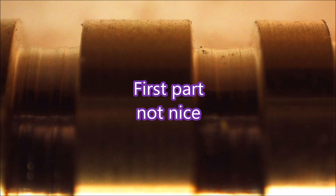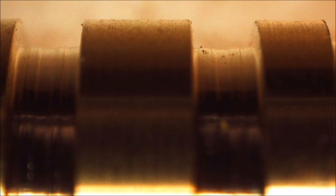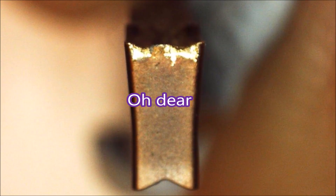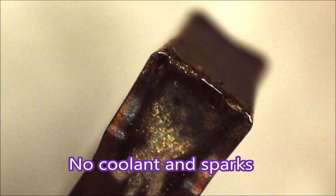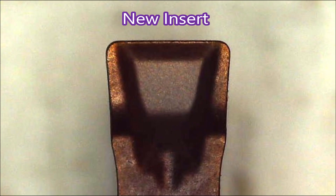This was what the bottom of the o-ring grooves looked like on my first part. I didn't see how badly damaged the insert was when I set the job up. My inserts don't normally get abused like this, but then I remembered I did a job in mild steel and the coolant stopped, and I had sparks coming off the machine — never seen that before.